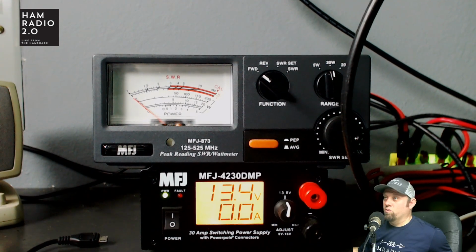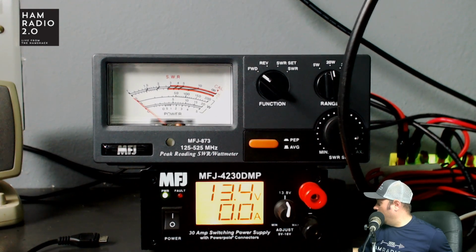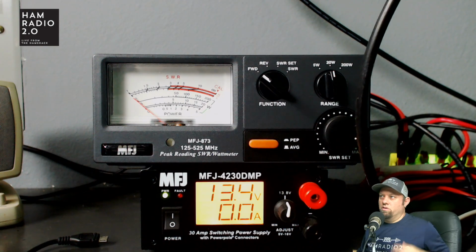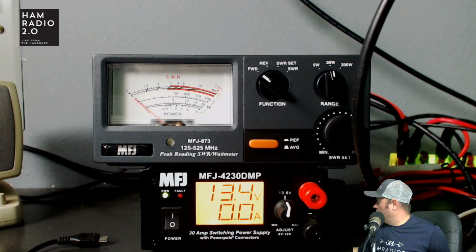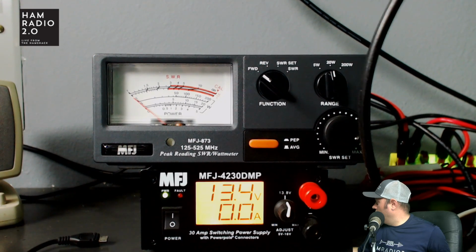TX power is 02. Okay, so go to menu, push up 1, Menu. 02. Power. Power is high, middle, and low, as I showed you a minute ago. On low, obviously, it shows an L. On high, it shows an H. And on middle, it just shows an M. So in the top left corner, you're going to see L, M, or H. So Menu. Let's go 2 meters here. Power. Confirm. Low power.